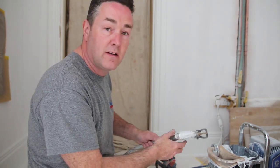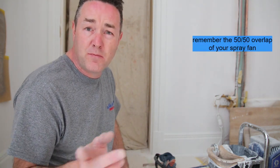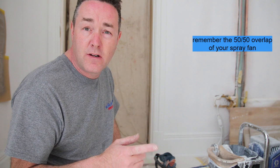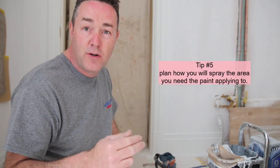So on that, I could do it in one, all the way across, up and down. You probably do about three passes with that, because it's quite deep skirting. That's probably a 7 inch deep skirting. So I'll go from that side to that side, then back, and then across the top, make sure the top edge is covered. So that's one of my tips, probably move quickly. Don't overthink it. Don't go over the surface, because you'll be building up the paint.